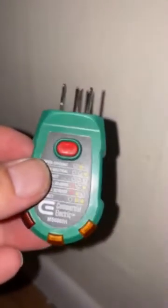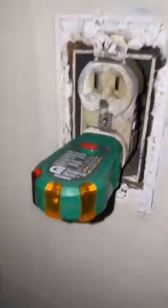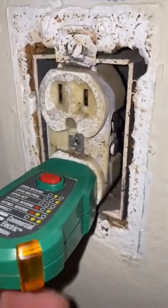While working on this, I noticed I needed to replace my router outlet. Just a note: when you're working on these circuits, make sure that even when you shut the circuit off, the positive — whatever you're working on — is off. Have a plug checker like this one. Put it in the plug and make sure you've got no lights. See how old this plug is? This is why we're changing all the plugs in this room.